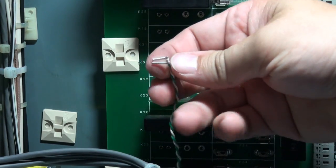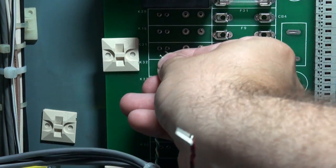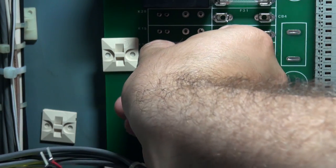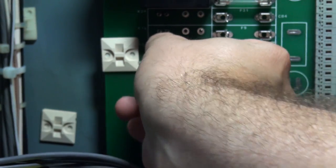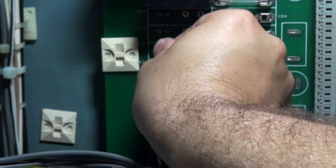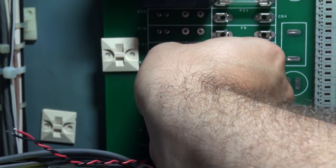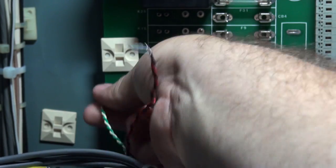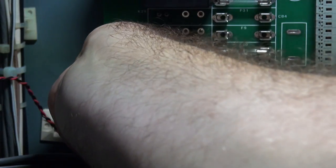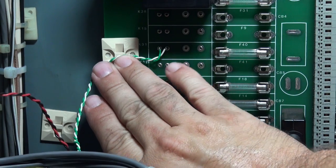And then I put a little sticky on the board right here, right next to it. So then we'll be able to just plug these right in to those pins, and it's like a little socket, almost like an outlet socket. So there's some friction in there that will keep the pins in place. So we can plug that in just like that all the way, and then we'll bring this up here and put a zip tie there. We'll put a zip tie here. So then we've got strain relief.